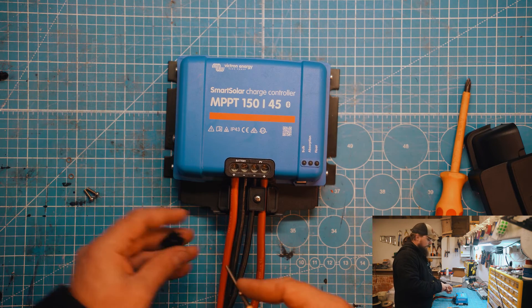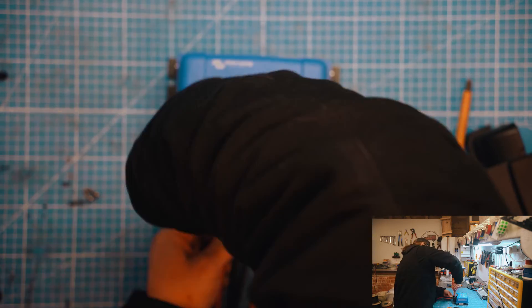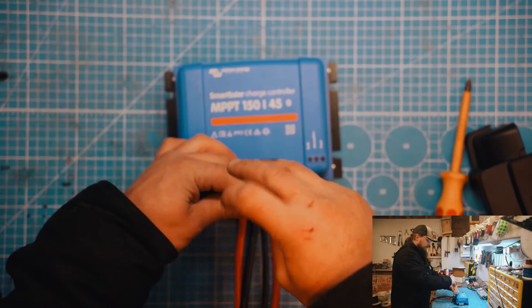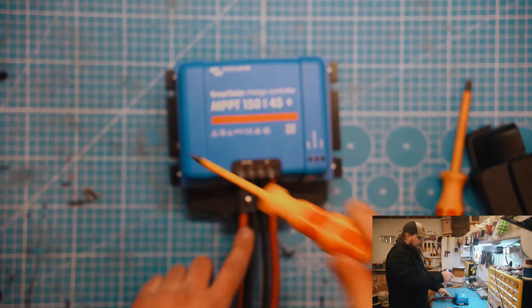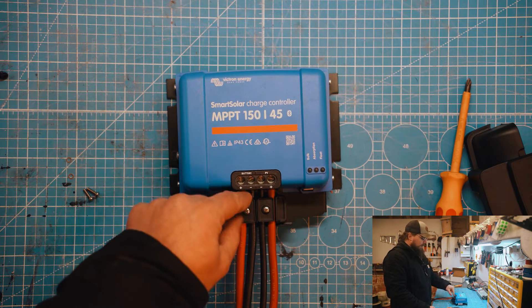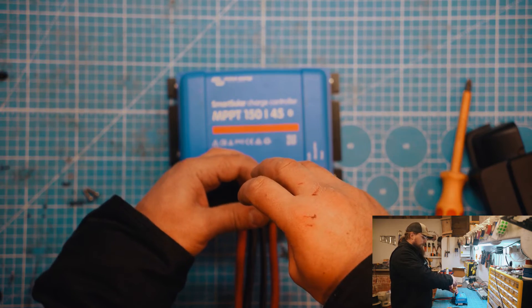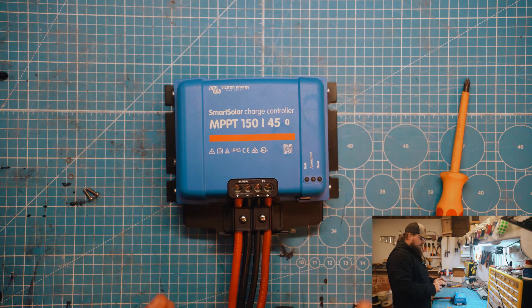Now we'll do it with uniform same-size wires. With 16 mil wire it's actually quite a challenge to get it through here sometimes — you have to fiddle with it. You want to really get that separator through there before you start trying to wind the screw, because that'll protect your wires so the screw doesn't actually cut the sides of the insulation. So that separates your wires nicely. If you don't push this through there first, the threads could cut through the insulation. I'd recommend lifting the wires up, pushing the clamp through so it sits between them, separating the wires — then it stops your bolt from cutting the insulation. This works really well because if there's any play on the wires, it doesn't transfer to the terminals.